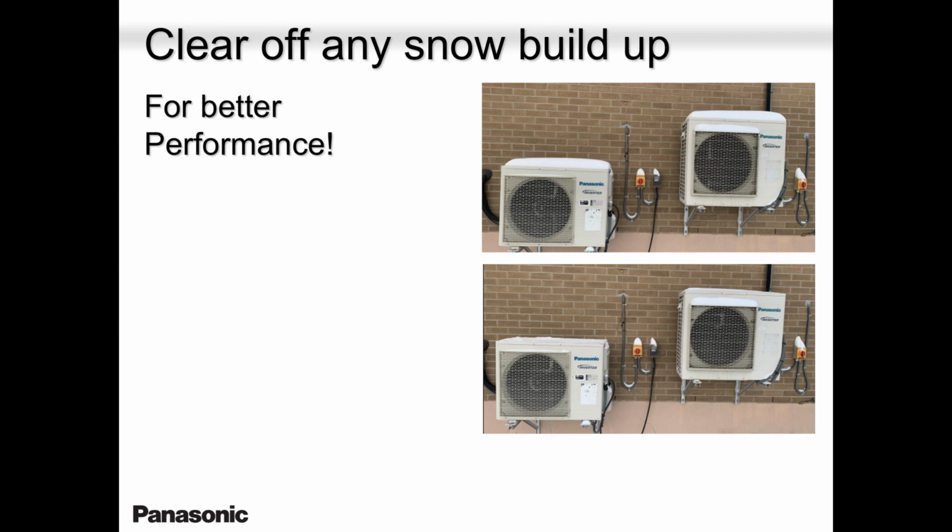It's just like their driveway. Treat the unit just like your driveway. You need to clear snow in 24 hours as per the municipal code. Do the same thing with the unit. Trust me, you'll get good performance. Because this snow on top gets frozen and just makes the coil feel cold. And next thing, every hour the unit goes into defrost because the coil is so cold.